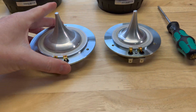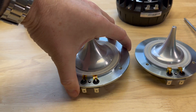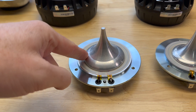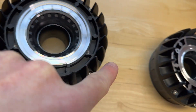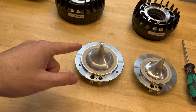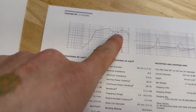Some details are immediately apparent. The basic construction between these two drivers is pretty similar. The energy comes off of this high-frequency diaphragm — the motor is all on the other side, so all the neodymium is in the top here. You can't see it without removing this little exponential thing. The energy comes off here and follows this all the way out to the exit, and it meets up with the mid-frequency energy right here. The mid comes out of these holes here. This is a patent-pending device called an impedance mismatch device, and that's what lets us have that really wide frequency overlap where you can see the high-frequency and the mid-frequency on the 354 and the 464 overlap for most of an octave.